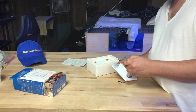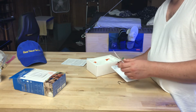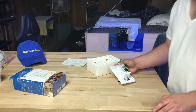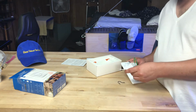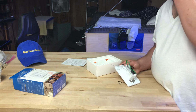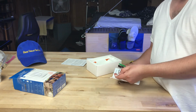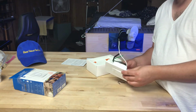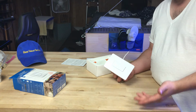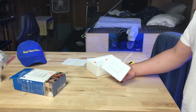So if you don't have a neutral, you could probably put it into the ground. Sometimes you're not supposed to do that, but I mean, that's not really local code. It should have a neutral if it's needed, but just to get this light switch to work, if you hook this up to ground, it's going to work and it's going to have the 120 volts that it needs. I did that on 2 switches so far about a year or 2 ago, and no problems ever since.